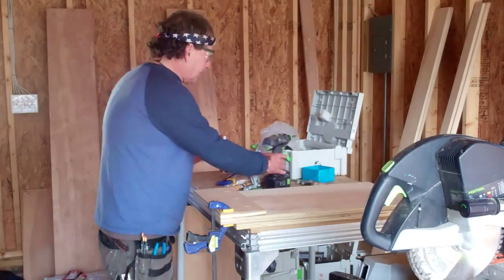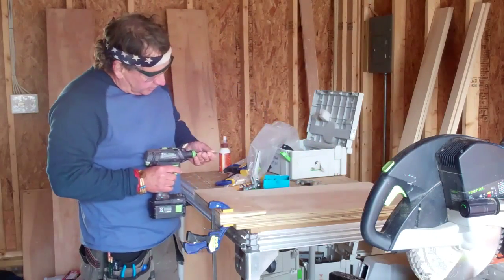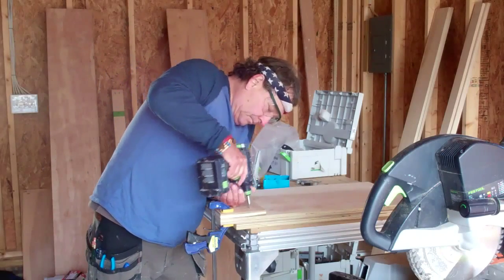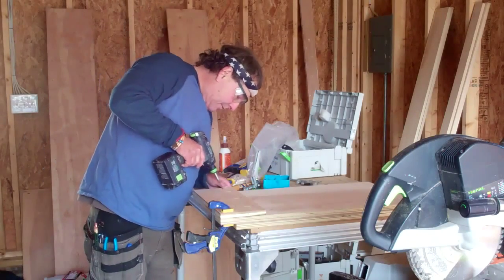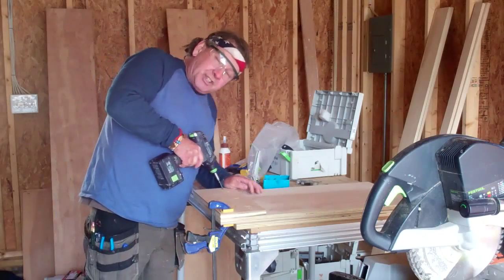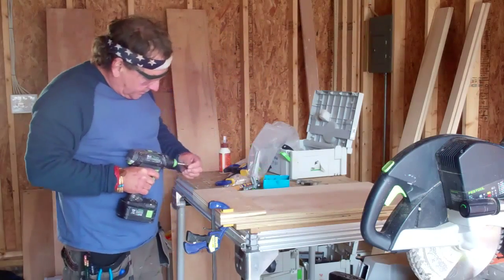I just prefer to throw a couple of McFeely's 1 3/8 inch sawtooth screws in here. And I put them in at an angle because you don't want them protruding through the plywood, because most plywood nowadays is a little bit shy of 3/4. So I usually put 4.